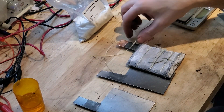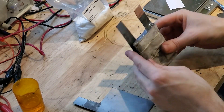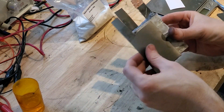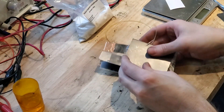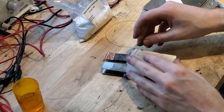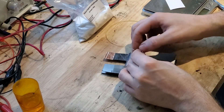In this battery design, there is no active material on the negative electrodes. We simply place a graphite foil on each side of the positive electrode. When charging, these negative electrodes will form zinc metal, which turns this all-carbon capacitor into a zinc-ion battery.